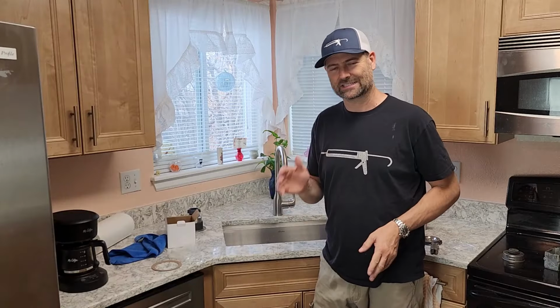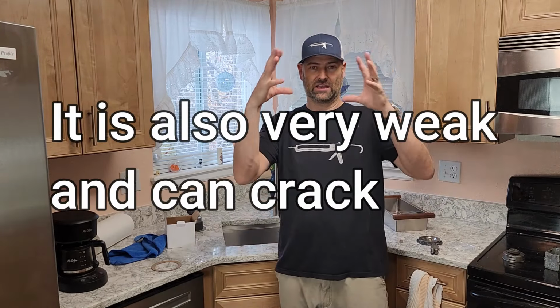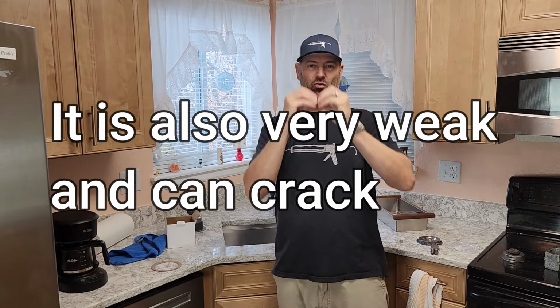This video is an example of what not to do. This is not a best practice drain install. It's also an example of what you can do in a pinch, and it will work. How long will it work? We're not going to find out. I have come across similar installs in customers' houses many times over the years. What can happen is those flexible ripples can fill up and collect food debris that go through your garbage disposal, and it will gradually restrict the flow.